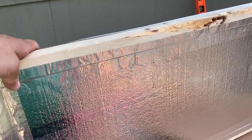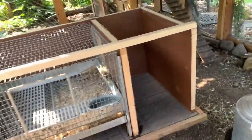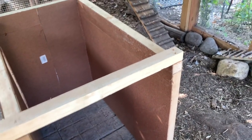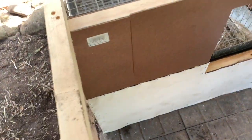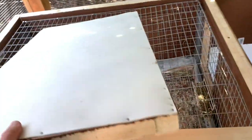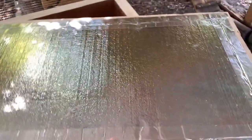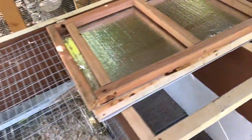Using premium construction adhesive, we'll fit this right on top. That's all pressed and intact — I toenailed that in with small nails into the center of the board, and then the lip of silicone will go around that so you'll never even see those. First I'm going to line the perimeter of the inside of the bunny house with more food-grade surface to be cleaned and wiped down as needed. The food-grade surface is roughed in halfway up around the perimeter, and I'll put a trim around it so the bunny can't chew it later. The bottom board has insulation on the bottom and the food-grade surface on top, mounted to the green-treated lumber base — slide that right in.